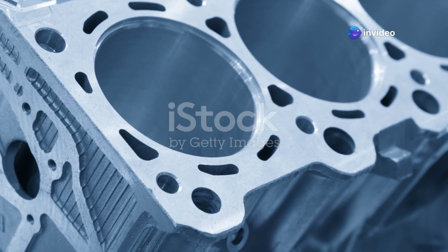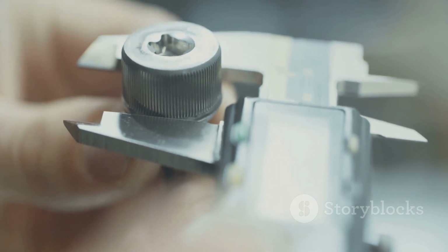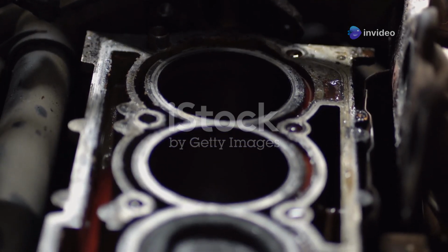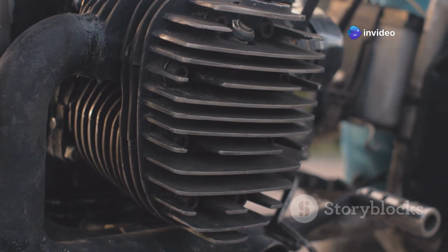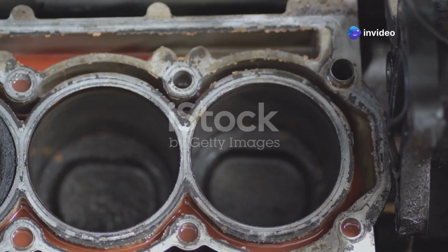The greatest improvement in air cooling has resulted from reducing the thickness of the fins and increasing their depth. In this way, the fin area has been increased in modern engines. Cooling fins taper from 0.090 inches at the base to 0.060 inches at the tip end. Because of the difference in temperature in the various sections of the cylinder head, it is necessary to provide more cooling fin area on some sections than on others. The exhaust valve region is the hottest part of the internal surface. Therefore, more fin area is provided around the outside of the cylinder in this section.